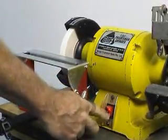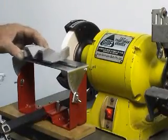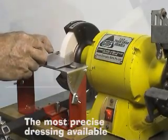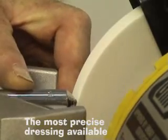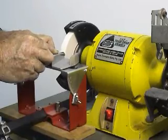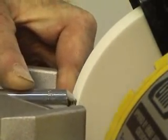Just as a sharp tool is essential to your turning, the condition of the grinding wheel is essential to getting the sharpest tools. A single pass from a dressing stone ensures the wheel is true and has a new abrasive surface. Manual dressing of the stone will never deliver the wheel square and true, which is essential for grinding. Yet most other sharpening methods do not have a precision method of dressing the stone.